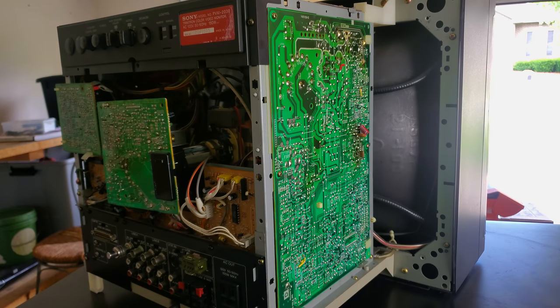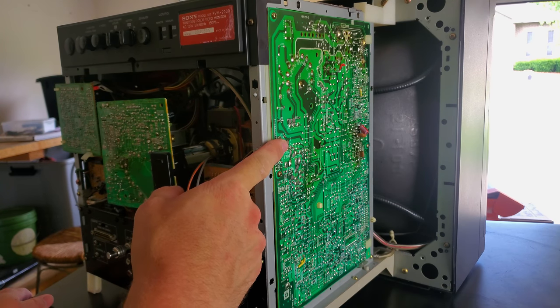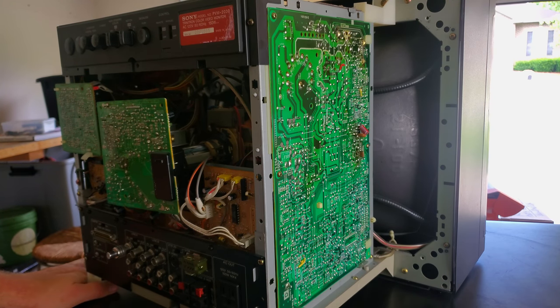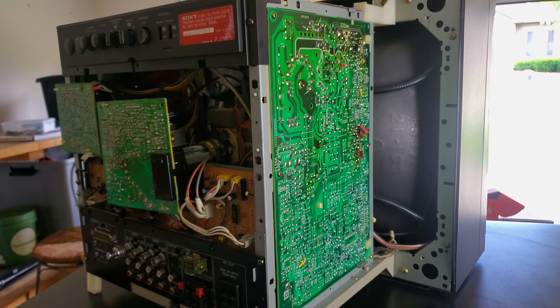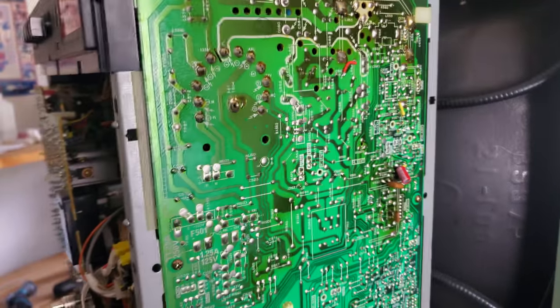Today we are starting in the back of a CRT — a Sony PVM 2030 being serviced here at the shop. I wanted to go through it and show you the ugly to start with. This right here is our deflection board, and it is the main board that controls a lot of the issues that happen on the screen. This video monitor had a bad issue of vertical fold over, almost like the vertical blanking problem you'll see in the 50 series and M series CRTs. I'll show you an example of what that looked like on screen. This is mainly caused by bad caps, especially in the vertical deflection area of this board.